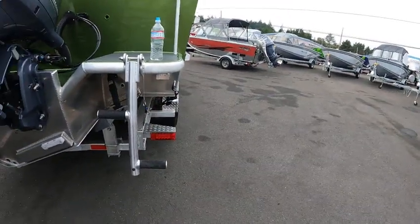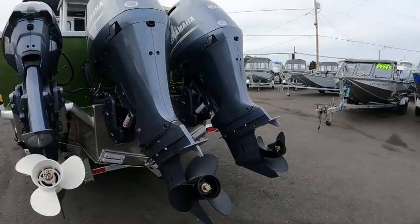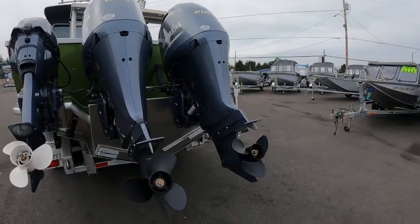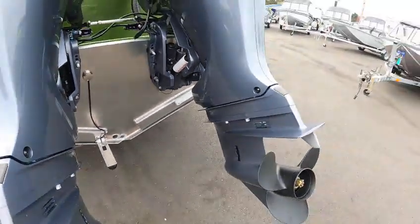You've got your trim tabs — those are good, five to six inch, probably bigger than six inch, reverse heavy reverse. That's awesome. The 200s inline fours have got a lot of power. The horsepower kicks in at 2200; most of them are 3800 to 4400 RPM when the horsepower kicks in. That big ring right there is for the center fish box; the other one's the main.